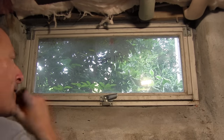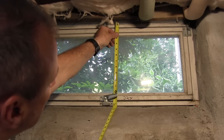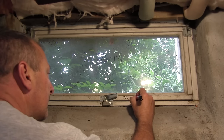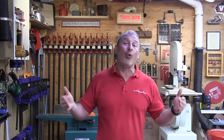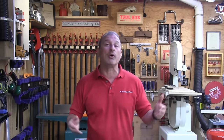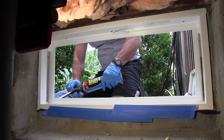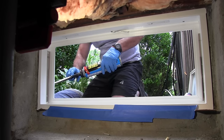For best results, measure from the inside — measuring from the outside is too complicated, especially with the sill. Once you start measuring, order your replacement window to fit that measurement or, better yet, make it a little bit smaller — maybe a half inch smaller on the width and height just to give you some room to get it in, because sometimes you have to fight these. The difference in space can be filled later with spray foam, mortar, or if there's a wood frame, trim around it.